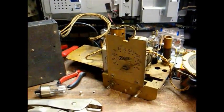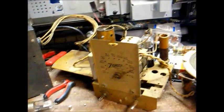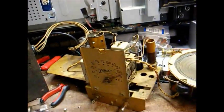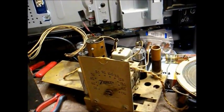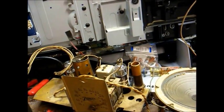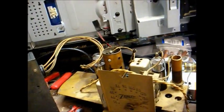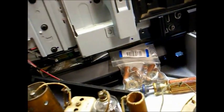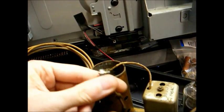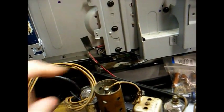Back on the Zenith Farm Radio from 1939, and I'd like to take a moment to demonstrate something that applies to all radio tubes, or should I say radio tubes that have a top cap on them, like this one did. Many radio tubes have a grid cap, and you can see this is the connection that comes from the radio that connects to the grid cap on the tube.